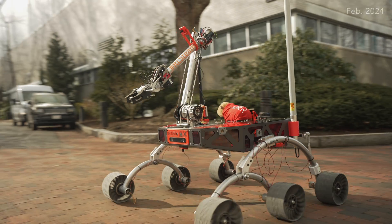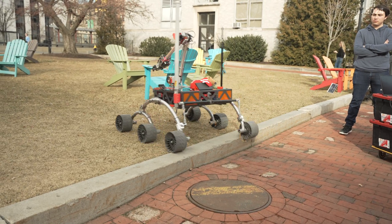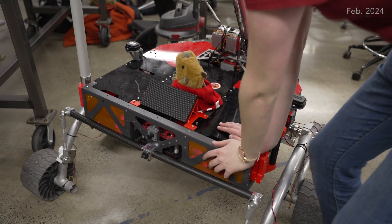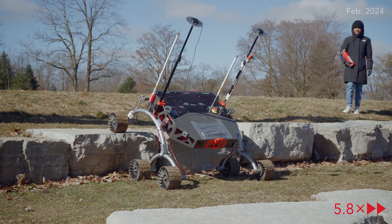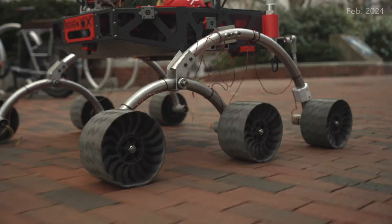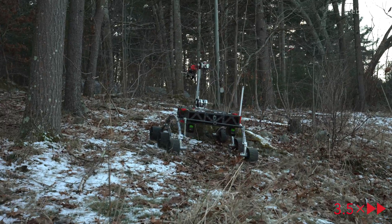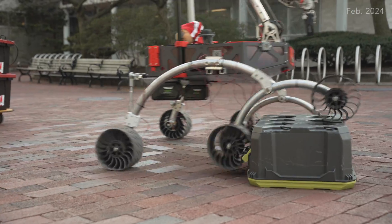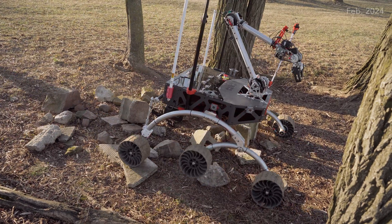Our 5052 aluminum chassis creates easy access to all inner components, lowering the center of mass and moving the CF differential bar of the rocker-bogie suspension to the back, which increases stability and reduces chassis rocking. Our Rover can reliably traverse sloped and rough terrain. The wheels are SLS printed of TPU-90A with nylon CF hubs, resulting in stronger wheels compared to previous years. The curved spokes allow for flexibility to drive over rocks and obstacles while supporting our Rover for extended travel.